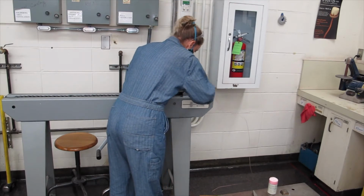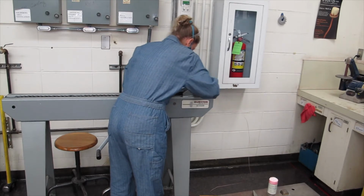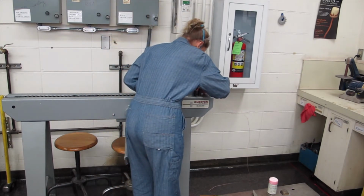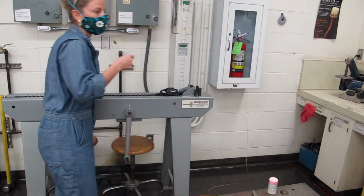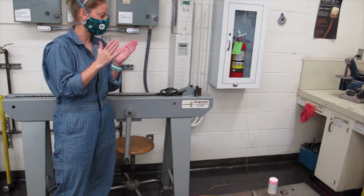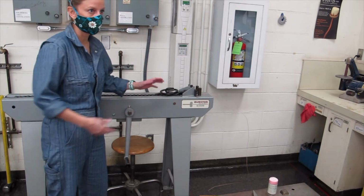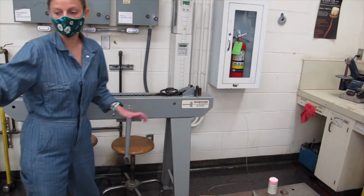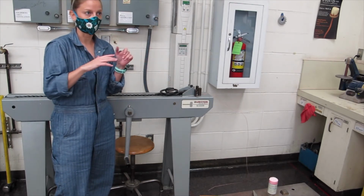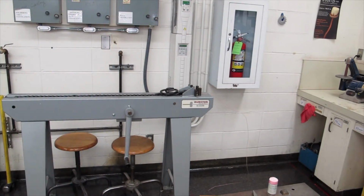Okay. So I don't have a huge tail, so it takes just a little bit of playing. So I just made it grab the tail there, and then I'm going to pull. So those prongs, they have a textured edge to them, which is what's self-locking. So if you don't have this like gigantic torture device at home, what most people are using is the vise, and you just place the draw plate in the vise while protecting it from the vise teeth, and then you just use self-locking pliers and you pull.